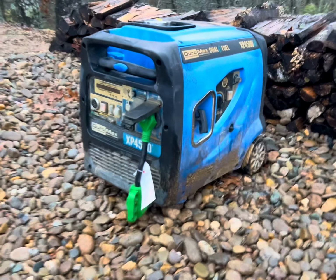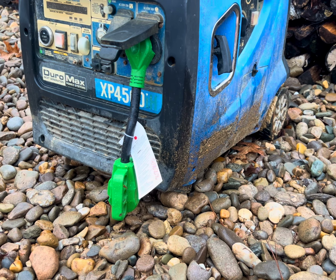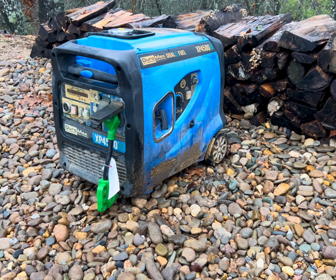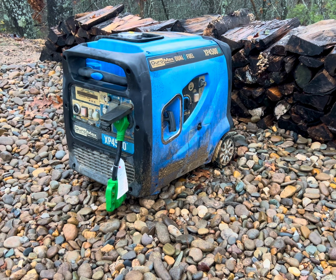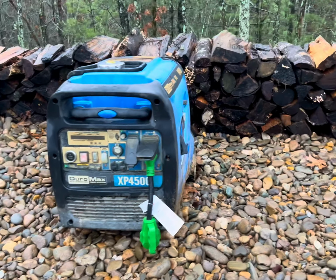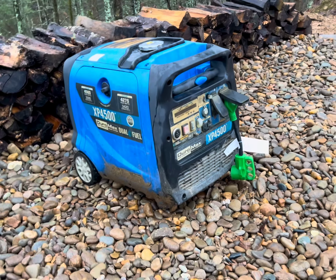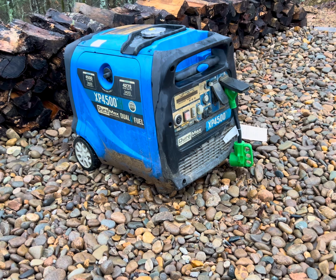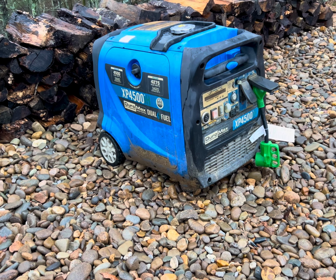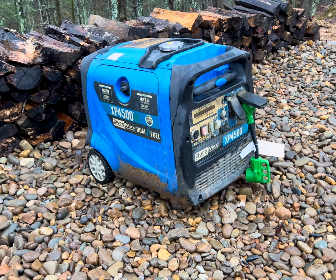Now you can also see here, I've got a plug that I just bought that goes from the 30 amp output plug to a 50 amp. I bought a smaller mobile home that I want to start doing some work on and just having another place to stay here on the property. I'm really looking to have a number of tiny houses on the property just to move around and see some different stuff, but I should be able to run all of the 120 volt circuits by plugging into the 50 amp RV plug that they have on that tiny house little mobile home.